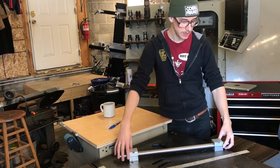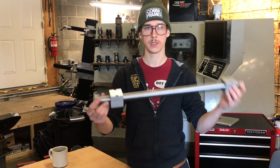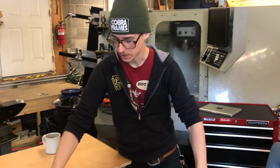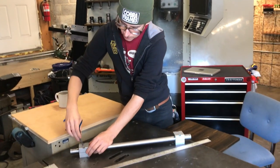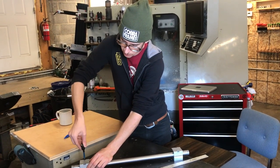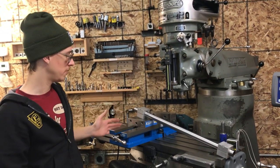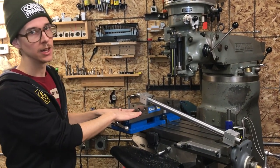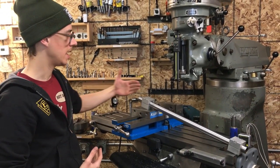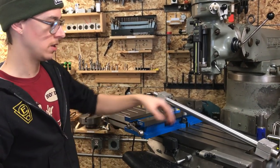These just allow you simple work holding for thin-walled tube, and they also allow you to phase the cuts. So we'll put this on here, tighten these up, head over to the mill, and I'll demonstrate some cuts. Here we are on the Bridgeport vertical milling machine with the Kurt-style milling machine vise. You wouldn't need a Kurt, but you need something that has parallel faces that can get a nice hold on the tubing blocks.